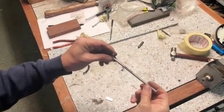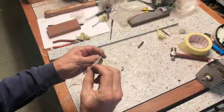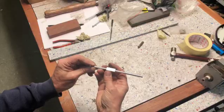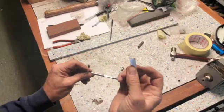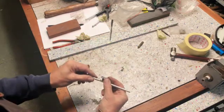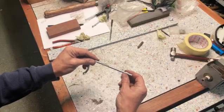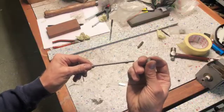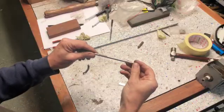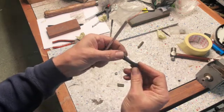For my magnet flipping mechanism I took a piece of solid aluminium — I think this is 8 millimeter — and I flattened an area there. That area is just enough to hold one of these neodymium magnets. I also made these two little aluminium tubing pieces that are cut with a little lip, so the idea is that I can change the magnets easily. This is just an o-ring with a piece of heat shrink in between.